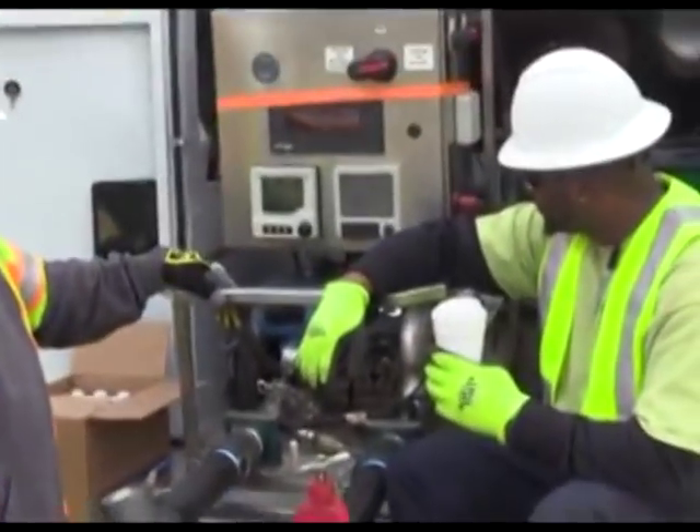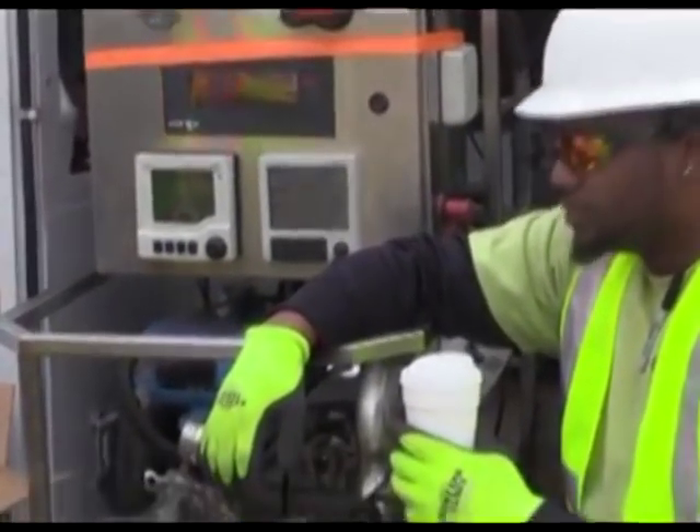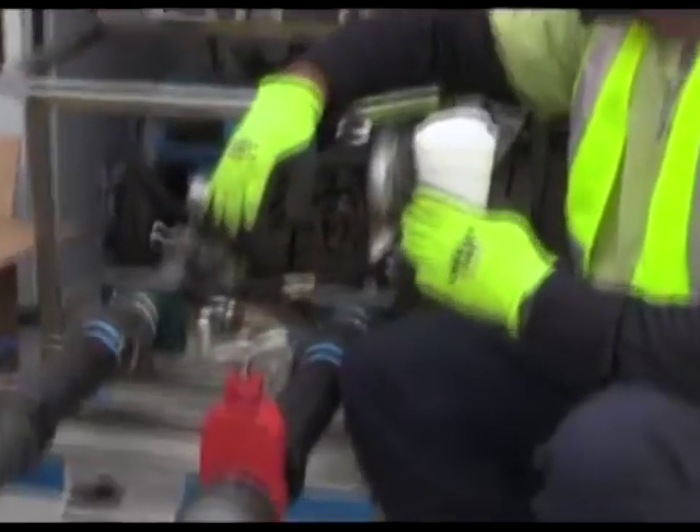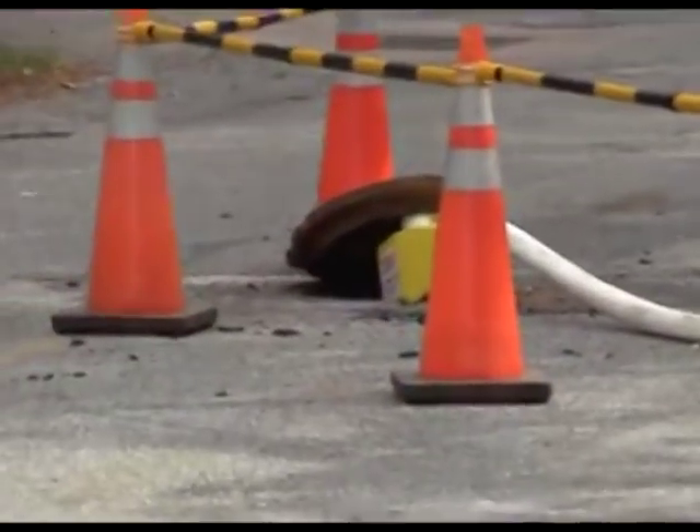So this here is the receiver truck, and what this does is it monitors the water as it's coming down the pipe. A sample of water comes through here, and a sample comes off the hydrant as it goes. The water goes back into the sewer. What we're able to do with this is tell when the ice pig reaches its set location so that we can remove it from the system — it doesn't get spread into the system, which would cause brown water.